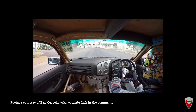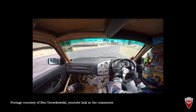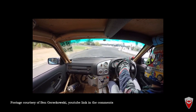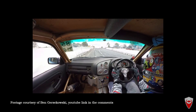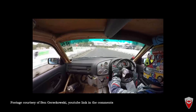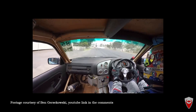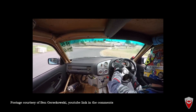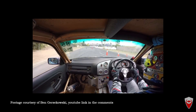So what is it good for then? It makes a bunch of lift — and I do mean a bunch of lift. Around the 10 degree angle of attack point it's only a modest increase in drag from the rest of the curve. So if you have an application where you're grip-limited and want an airfoil that will give you as much downforce as possible for a given wing size, this is right up your alley. A typical use case would be street sprints, autocross, gymkhana, etc. The car isn't going fast enough for long enough to be concerned about drag penalties. You just want as much downforce as you can fit into a package and you only plan on using the wing settings to balance out the front and rear of the car for handling, as opposed to getting that straight line speed. I've used airfoiltools.com as a resource for geometry and lift/drag data. The properties are generated from X-Foil, which while only providing theoretical airfoil properties is a very good starting point for wing development. Links to both are down below.